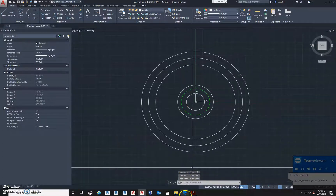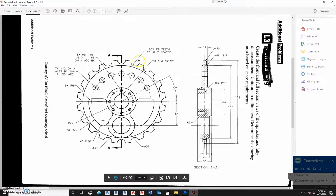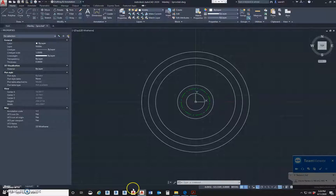The next thing we're going to do is draw these teeth here. But first, I should probably put in my center lines on the X and Y axis. Then for the teeth we've got to get these arcs — they're showing there's 20 of them with a radius of 9. So once I get this axis in, I am going to draw a circle from this point, draw the radius of 9 and then trim it. And then I'm going to use the polar array to go around here. This tells us there are 20 of them.